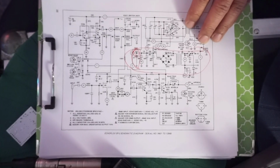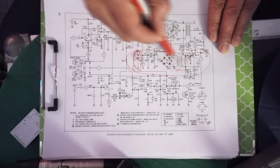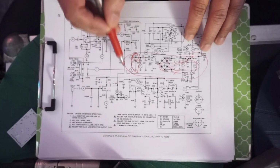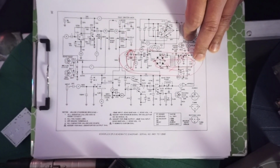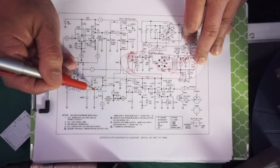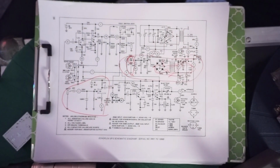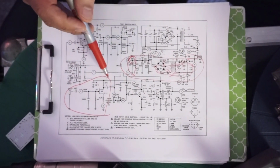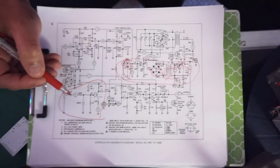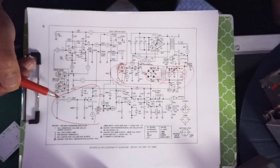And we're doing something very similar without the wall stuff. I'm doing a different technique here to get 9 volts up to 27 volts, and then we're pushing it back to 22 in a similar way here. But when you plug your guitar in, here's the input jack, and here's the JFET. So once again, when you talk about the EP3 bass preamp pedal, it's not much there. There's a JFET and a few parts, and they're very important parts, and we've reproduced that in the Deluxe, but that's really what we're talking about here.